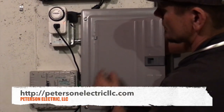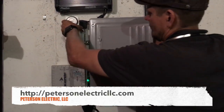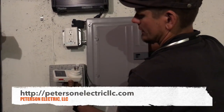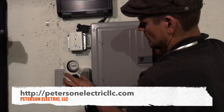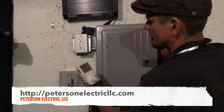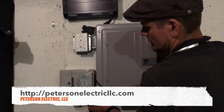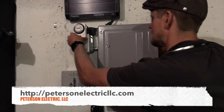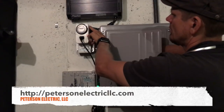He's keeping it fairly simple. This timer will turn the system off and on. It's just a simple light timer, but the light timer does have to be rated for the correct wattage. In this case it should be fine because this little contactor probably pulls less than a quarter amp. We hit the test mode here to show it switching on and off.